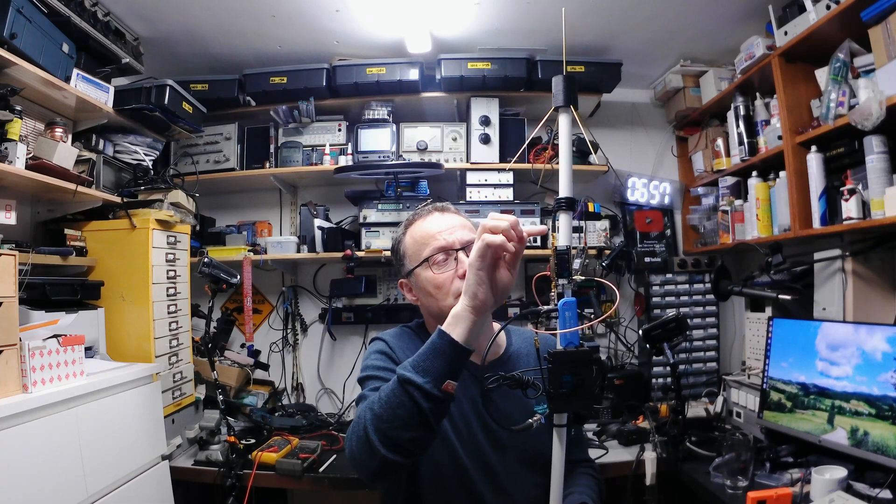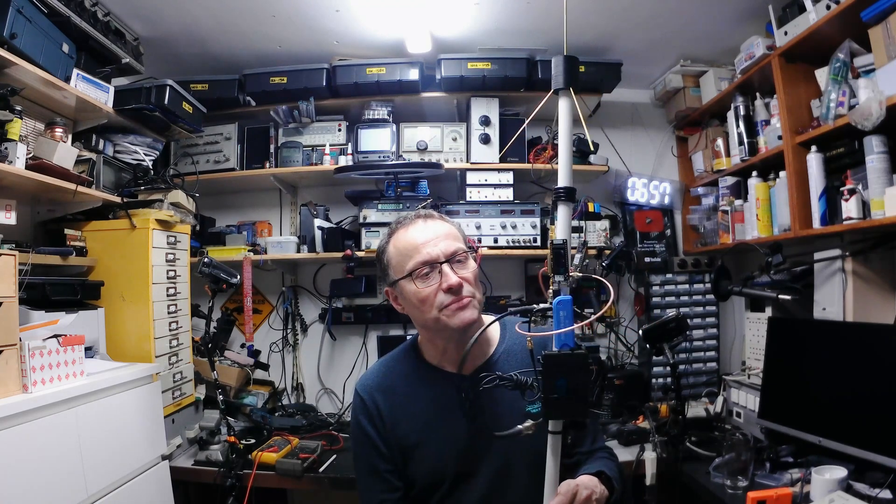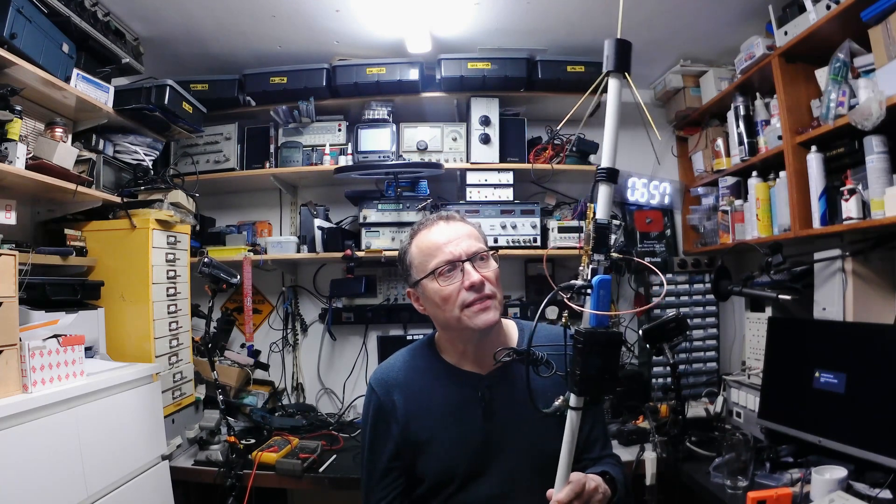Those are the two UHF items. The APRS sends the decoded packets via APRS-IS — which I think stands for Internet Service — to the European server via Wi-Fi. You can look at that information at APRS.FI. Now, it's not a secure system, APRS — so if you find me, you'll know exactly where I am if the position's been updated recently. It is a ham radio system, so you need a call sign to operate a transmitter, though maybe not a receiver.